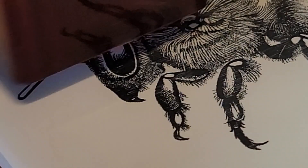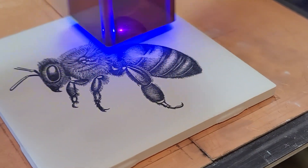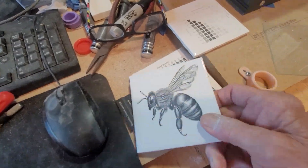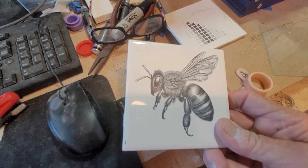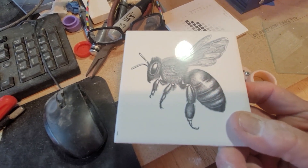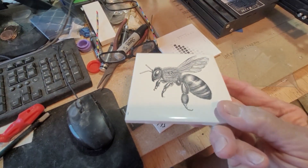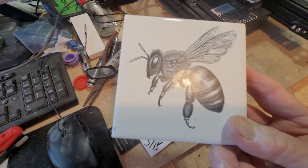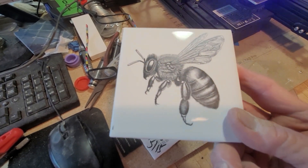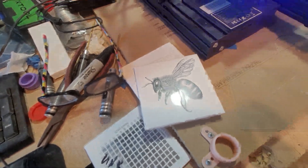See all that detail in there — it looks really nice. I've done quite a few of these and I'm going to be doing little videos to display them because they're so pretty. The surface is fused, it hasn't broken the surface so it's still waterproof. The titanium dioxide has changed its crystalline structure so that it no longer converts ultraviolet to visible light, which is what makes titanium dioxide white to begin with. But anyway, there you have it — my AI-generated bee burned with the Falcon 10 watt.